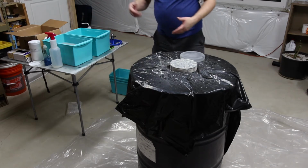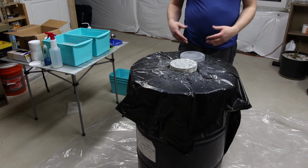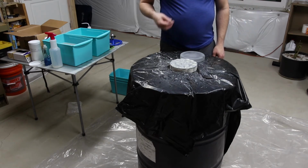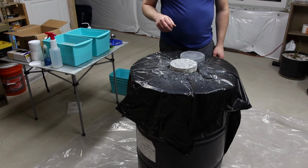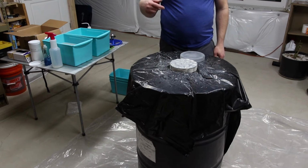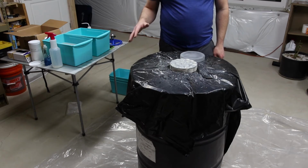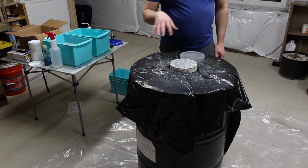So knowing that, every wet, again, that's every cycle of putting new grit down, seems to take me down a couple thousandths of an inch. And I can continue to gauge that by how much longer I need to go. So if I'm at 30 thousandths and I want to go to, say, 44 thousandths, that's 14 thousandths of an inch deeper. That's going to be about 7 more of these wets.